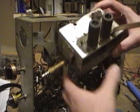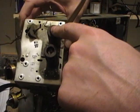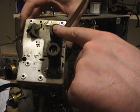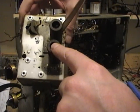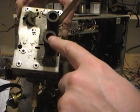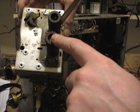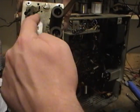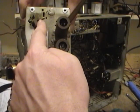This tuner itself, so the twin lead comes right into this guy, which is a 6AG5 RF amp, and this is a 6J6. It does double duty as the oscillator and the mixer. It's a dual triode tube. And here are the various tuning slugs. This is the one I tweaked already when I was aligning the video IF.